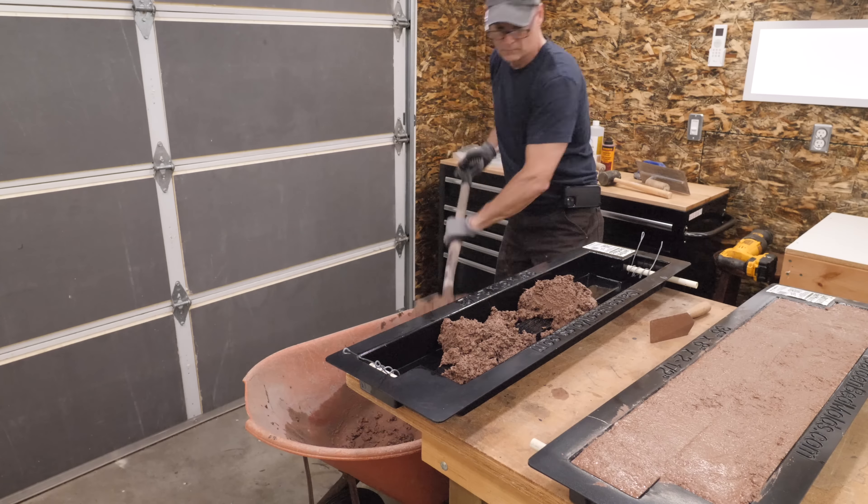This time, I purposely waited longer before pulling out the pipes to see how well the petroleum jelly worked. All the pipes came out without issue. There might be a buildup of petroleum jelly left on the molds when the pipes are pulled, but this is easily wiped up. All the pipes in the 24-inch vermiculite blend castings also came out without any problems. I'd say using petroleum jelly on these pipes works better than mineral oil.